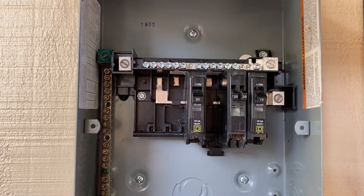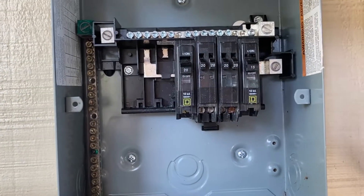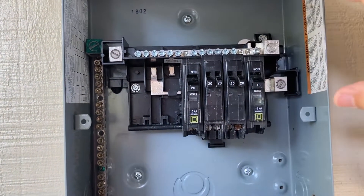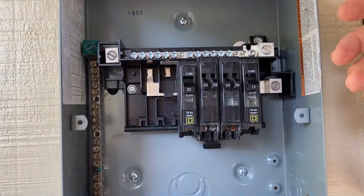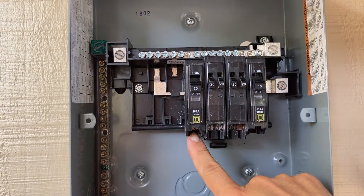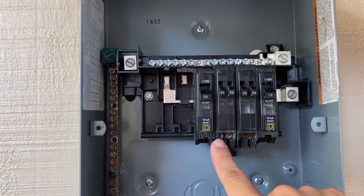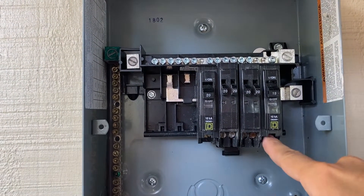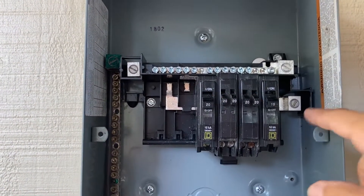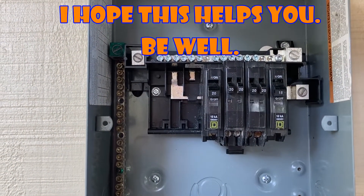While playing with the box, I realized there's a way to cheat the system — you don't have to use a double-pole breaker, but it's safer and less ghetto if you do. If you're stuck in the middle of nowhere, you can put one leg on this breaker and another leg on this breaker, and do the same over here. It serves almost like a double breaker because they're pulling from different legs. Just extra information that may or may not be useful.